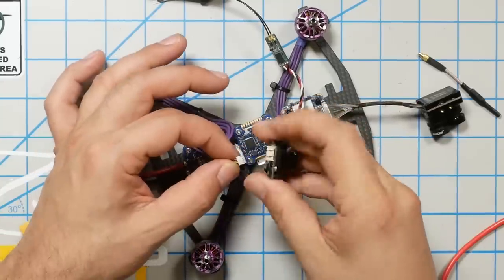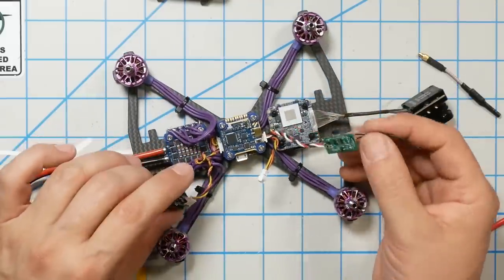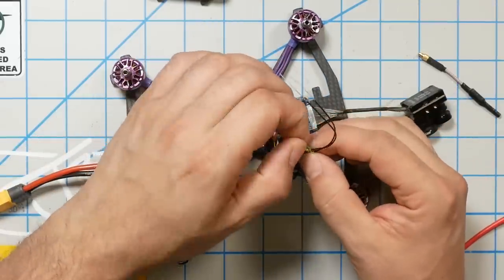I'm going to get a replacement RunCam and by the time I finish the video you'll see the quadcopter fly. But let's look on the bright side: the motors work — we hear the startup tones, which tells us the ESC is working and seeing signal from the flight controller. That's a big green check mark. The receiver powers up fine, the video transmitter shows signal. This quadcopter is ready to take to the computer for configuration, which is what we'll do in the next video. I like to do configuration with it open so I can easily access the bind button and fix any mistakes without taking it all apart.